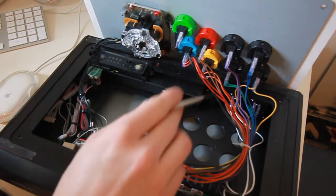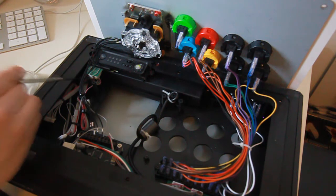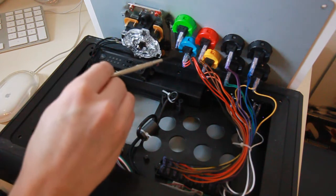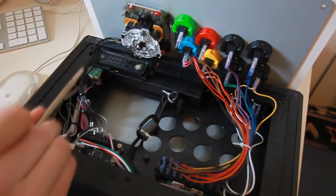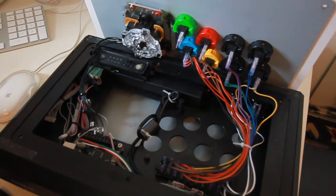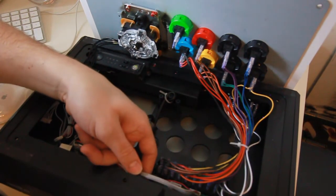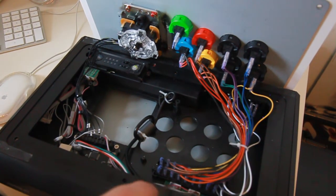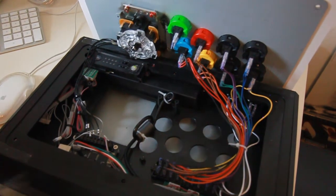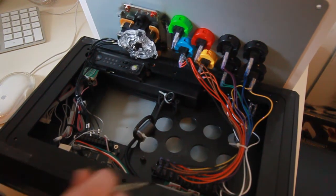We have 20 ports on here: 8 buttons, your start and back buttons, two grounds, five from the stick, your turbo, guide and ground button as well. On Delusion's video he used all 20 wires — one pair wire, 8 and 2, which is your live wire sending the signal, plus a ground wire. To make life easier, they all come into a rack here and mount onto a board at the bottom. There are two ribbons that come out of the bottom, each with six wires — five corresponding to a button with one ground, another five corresponding to a button with one ground. That's your ten buttons and two grounds, and they're labelled on the board. I'll put a picture up right now.